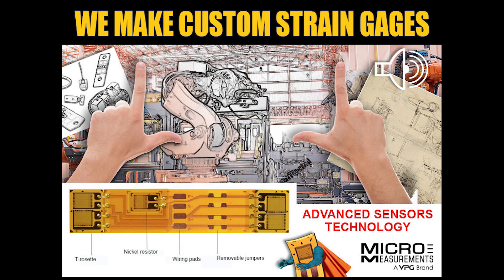This new design is to measure axial and torsion. We're going to develop a custom sensor where they can install two of these on each side of the tool and wire them together using a flex circuit. It really helps to eliminate potential sources of error in the gauge layout, like if you try to use individual gauges. We're basically going to have a single backing that has both axial and torsional grids on it.